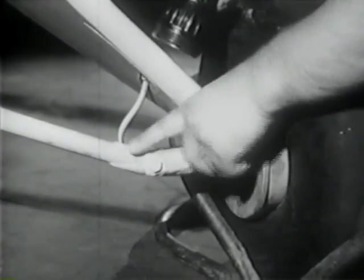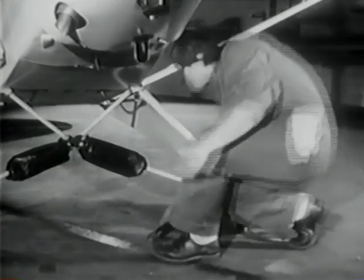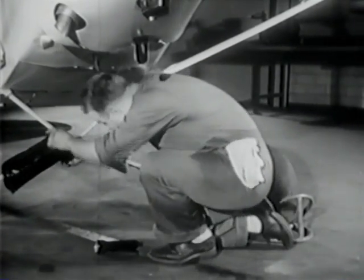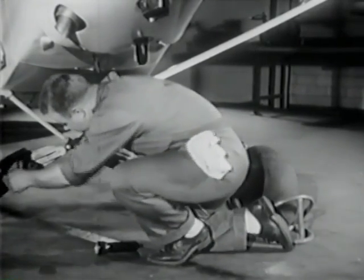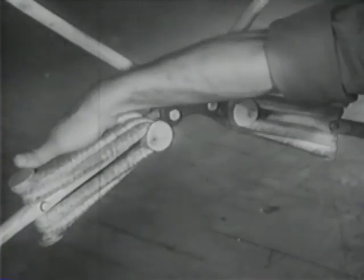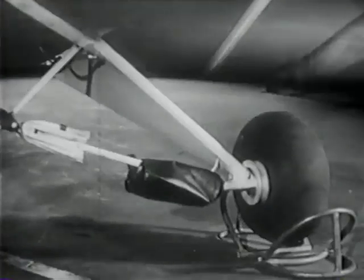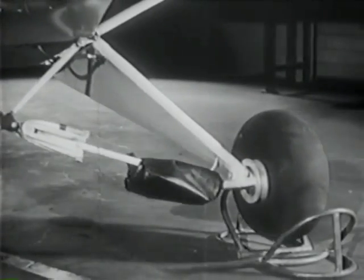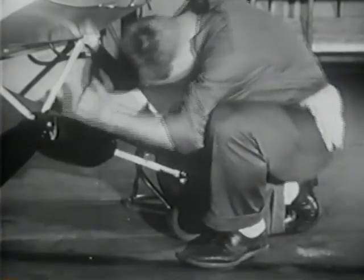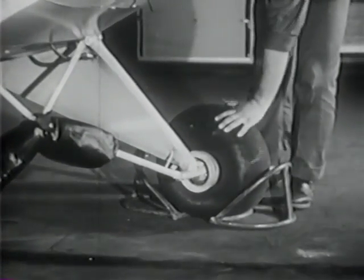Check along the tubing near the well too. To ease the strain on the landing gear, shock absorbers must be taut and whole. Take a look at them. Even if the cords look and feel all right, check further. If the cords are really tight, the wheel will leave the ground as soon as you lift the wing. These shock absorbers are still okay, so replace the covers, check the left wheel, and you'll have finished inspecting the landing gear.